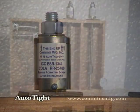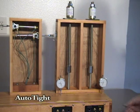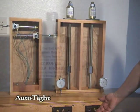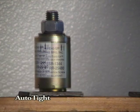This demonstration wall illustrates how the mud sill will flex and fail during a lateral event with loose tie-downs. Test number three demonstrates the action of a shear wall connected with a screw-type shrinkage compensator and the wall movement with no shrinkage. Dial indicators mounted on the base show system backlash — in this case about two to three thousandths of an inch.